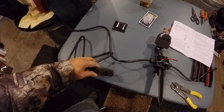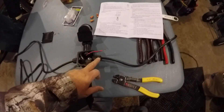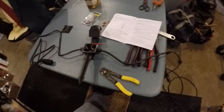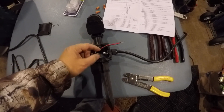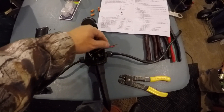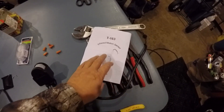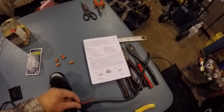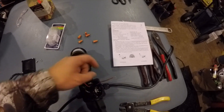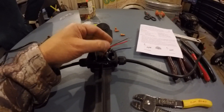I got the wire stripped. The female outlet side, which goes to your prop, is on the left side as you're looking at it; power coming into the sensor is on the right side. Each side has a black, white, and green wire. On the sensor itself — which you'll hopefully get paperwork for from eBay — it comes in three colors: red, brown, and blue.